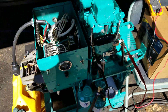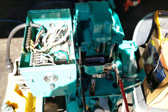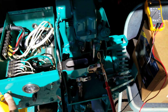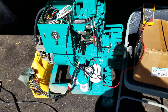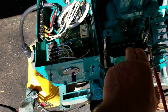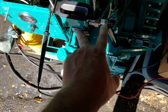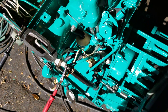It's alive! I'm going to back off here because this thing is loud. I can't run it too long — we got the cooling tins off of it. Let me shut it down. There's something going on over there — got fire or something, an emergency signal, but that's not us. So if you saw the meter, that is true. When I released the preheat button, I did see the preheat plug dying down as far as intensity, the cherry redness. But when I hit the start button, I saw voltage going in there. So that is true. I'm going to do it again.